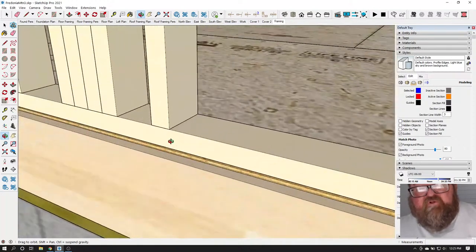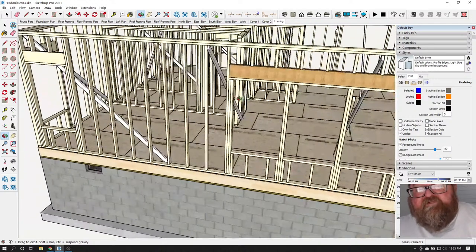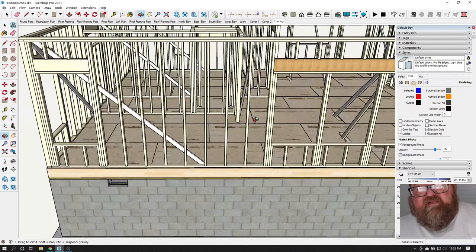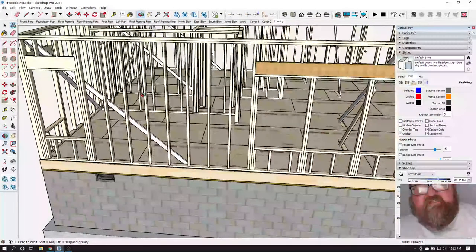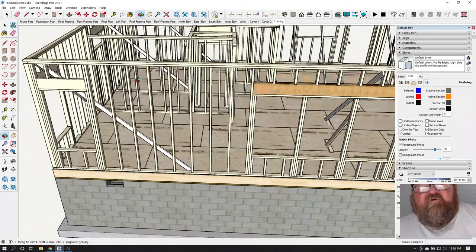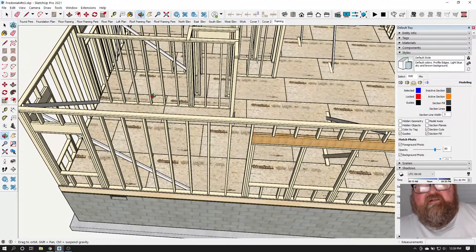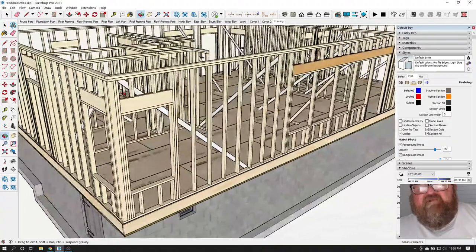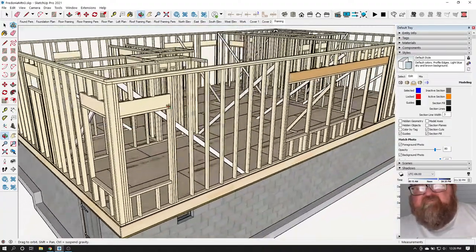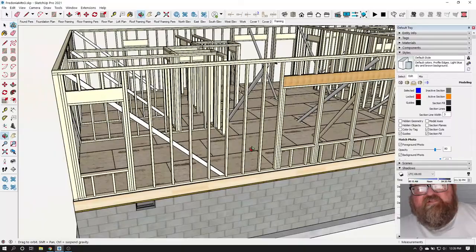The OSB is nailed into your bottom plate and top plate, and that gives you good strength. The strength axis of OSB is vertical — four feet wide. You see a lot of people laying it down horizontally, and it works, but OSB is supposed to be stood up so the top gets nailed to the top plate and the bottom gets nailed to the bottom plate, and all your verticals nail into the studs. That creates a big X of bracing in the wall. Back in the old days when we didn't use OSB, we used crappy blackboard, and the only way you could brace a wall was with metal strap braces.